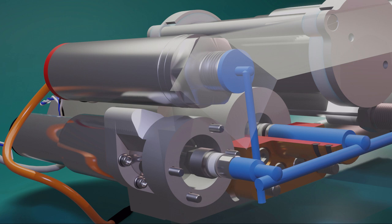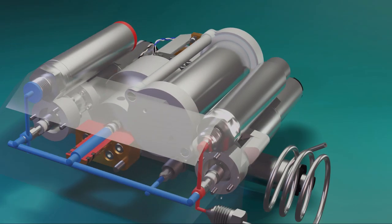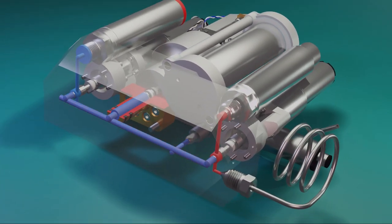After completing this measurement process, the zero valve is closed and the pump piston is extended, which returns the manifold pressure back to ambient. Then the ambient valve is opened, which re-exposes the primary sensor to the ambient outside seawater pressure. With both ambient and primary sensors connected to the external seawater, the instrument is back in its normal operating mode.